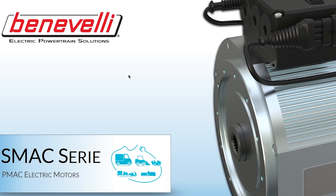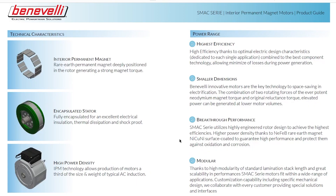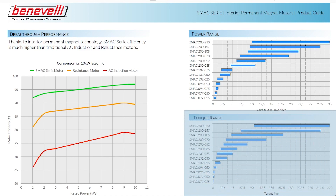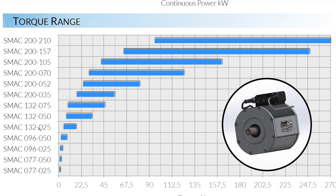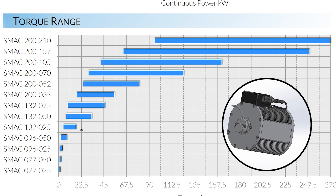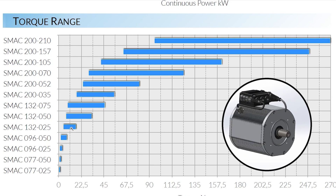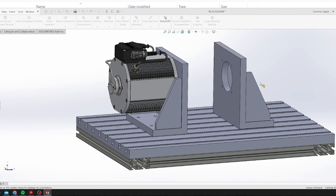Let me also say a few words about the motor. You saw the motor model and the composition with the bracket in the previous video. Here is some technical data about the power and the torque — you see the efficiency of the motor with the rated power. Depending on the model, you see the torque range. We're going to start with this motor, model 132025, and the torque range is between 5 to 15 newton meters — exactly what we saw in the brake datasheet.